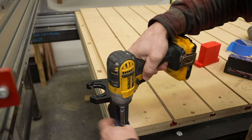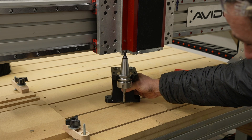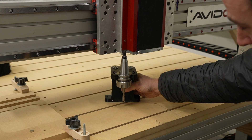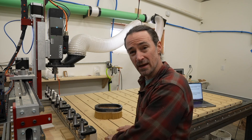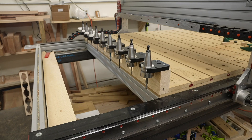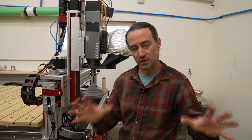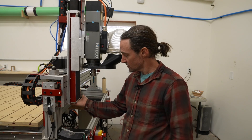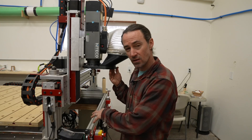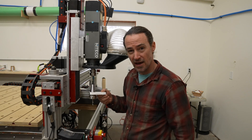The next consideration is the maximum tool height you may be using. I was considering using some 3D printed tool pocket holders and they're good to illustrate some of the problems. Basically you can't have your tool holder be too high where it would actually hit the gantry if the gantry has to move over it, so that really limits how high you can put it. If you're going to have your tool holders over the MDF spoil board, your bit heights are severely limited. The obvious way to work around this is to have the bits hang over the back of the spoil board so they have plenty of room for large bit heights. Potentially the best rack position is in the front of the machine — you won't have any limitations with the gantry hitting the tool holders, and it will be completely higher than your spoil board allowing you to still get a 4' x 8' sheet of plywood underneath it without obstructing anything.